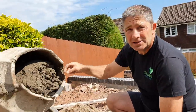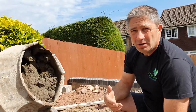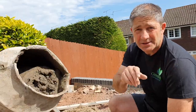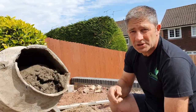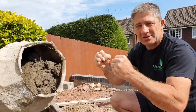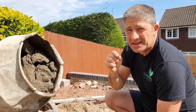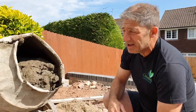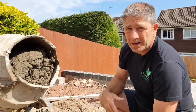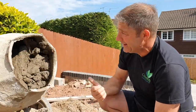Here we are at the mixer - there is mortar in there. The biggest question I get asked regularly is what ratio of sand and cement to use for a good laying bedding mortar for slabs. I now use all sharp sand completely - years ago I'd always use four sharp, one soft, one cement, but now it's all sharp. That aggregate within the sand gives it integrity in the bedding mortar. I've put hardly any water in there because the moisture is already in the sand. So many people first thing they do is chuck half a bucket of water in, then the sand, and it's all sloppy. Very minimal water in there.